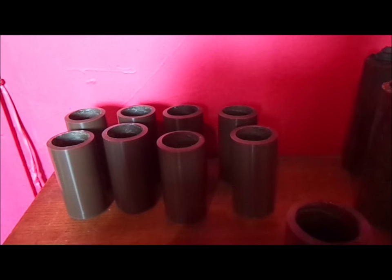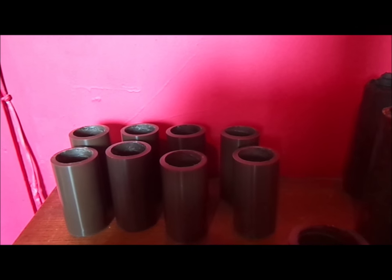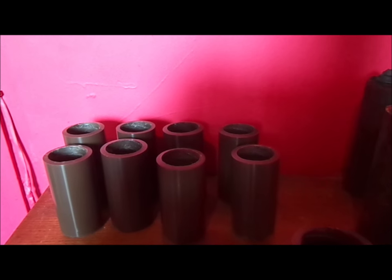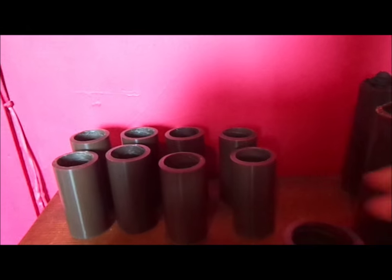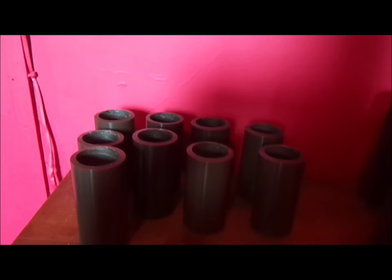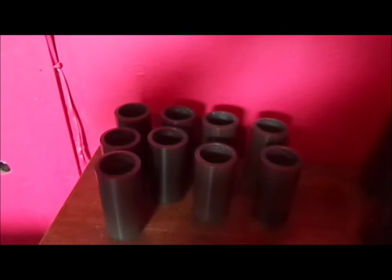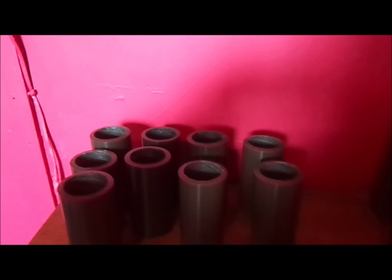They found that the aluminum stearate itself was too hard, and it wore out the cutters and caused problems. So they figured out that they needed to soften it. Their first trial of softening was a substance known as oleic acid, red oleic acid. Well, what happened was pretty dismal. The oleic acid came to the top of the blank, making it unplayable.